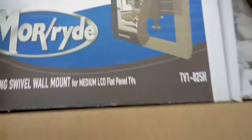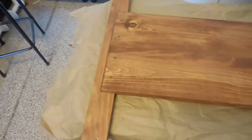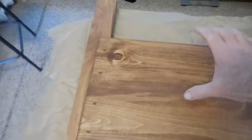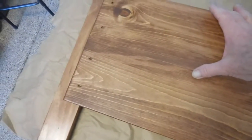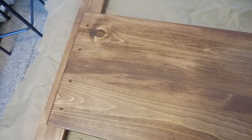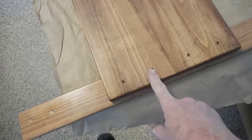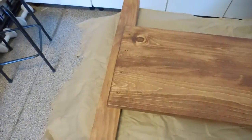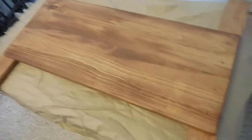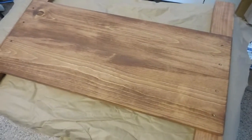And that's that feature right there. Two pieces of one by six — these are actually dimensioned at five and a half inches, so this is an 11 inch wide piece of wood. This will be screwed; each plank will be screwed in at each side. I will not be putting glue in the event I need to pull that off of there. I'll go ahead and assemble these two pieces together and then apply the wall mount.